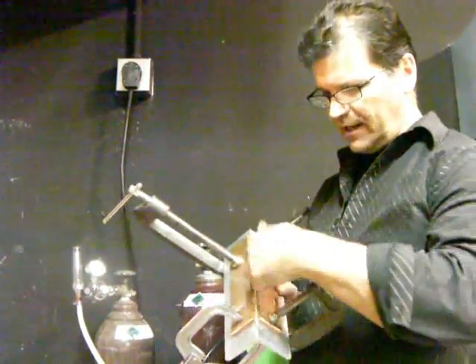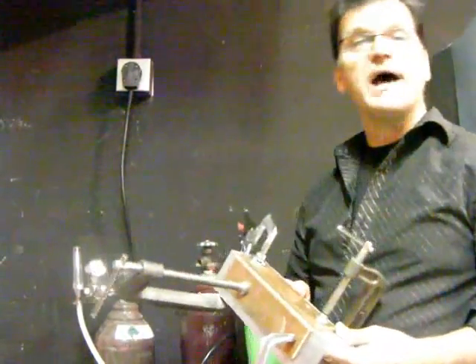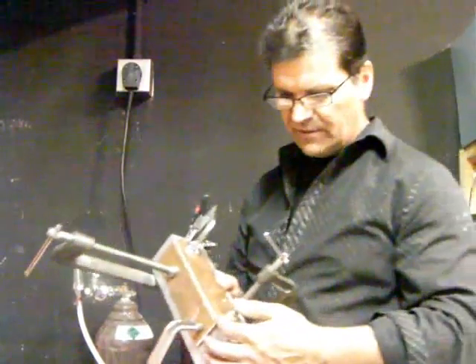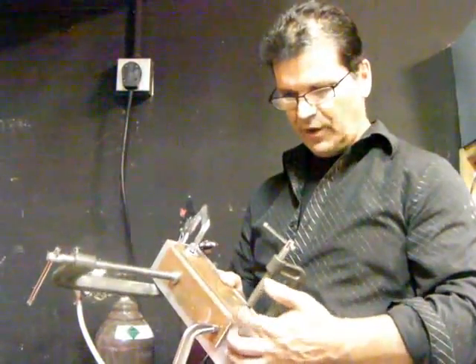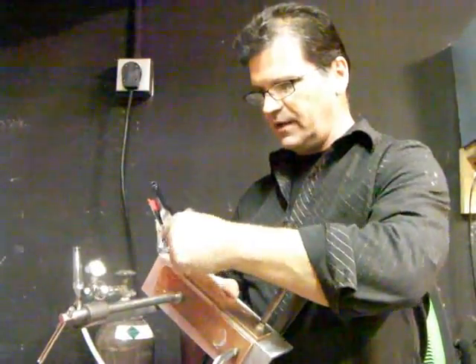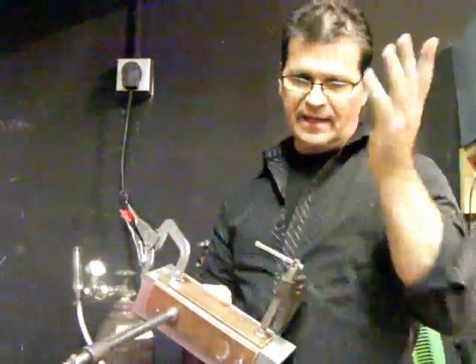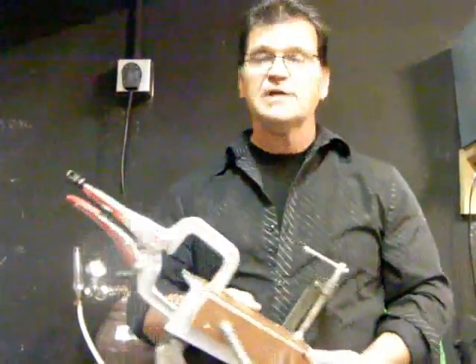That gap is going to trap argon gas in that little trough. I'm going to weld these pieces and bridge these corners with aluminum bronze — just with weld metal — and put an overlay of beads on there for something to hold it, because I don't have any extra copper to bend the straps to hold this stuff together. That's just a down and dirty way to do it, so I'll just bridge it up with weld metal.